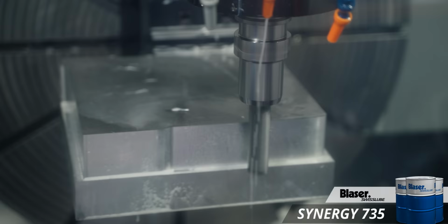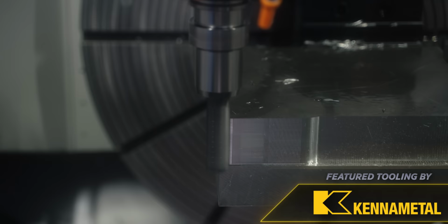But as you just saw, when the tool reaches a certain point in the material, we got a ton of vibration. So I'm gonna go back and rewrite this and decrease that step over in order to decrease the amount of tool pressure. So hopefully that's all we need in order to get this to work.